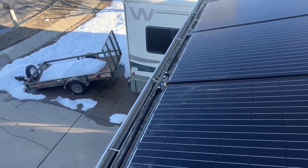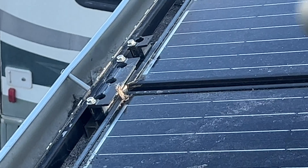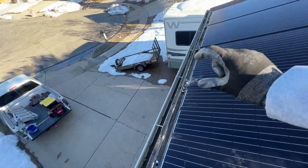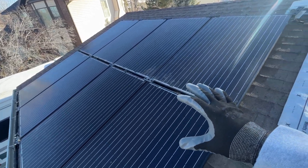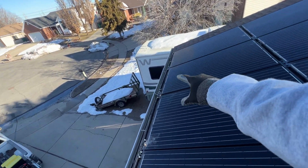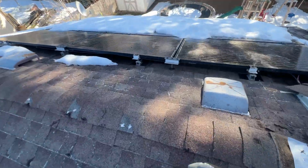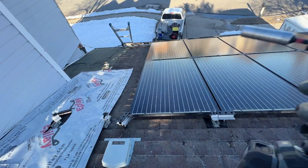Right there — I haven't touched this system. If you just zoom in right there, you might be able to see it. Those clamps are not tightened to the panel. It clamps to the frame of the solar panel and then bridges to the frame, so the frame on the panel is kind of the structural part of the system. These attachments just hold the frames together. You see that a lot where it isn't tightened, and sometimes on the top row, one of these is loose and it's fallen off.